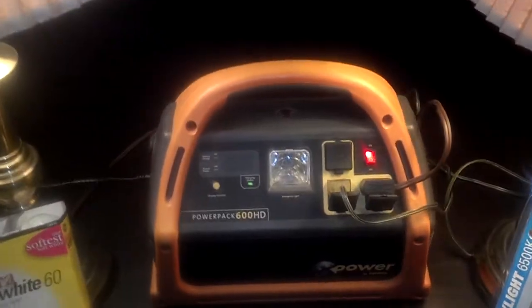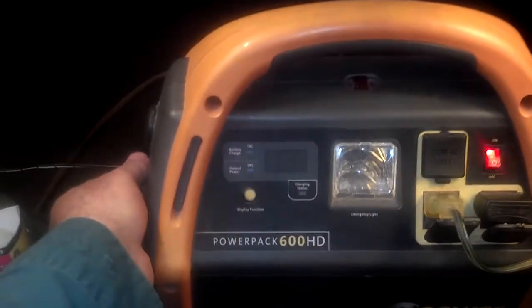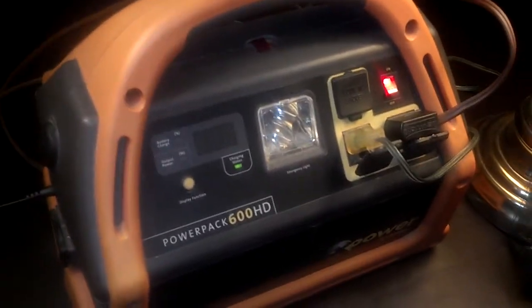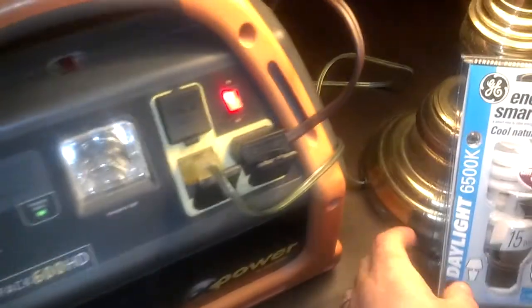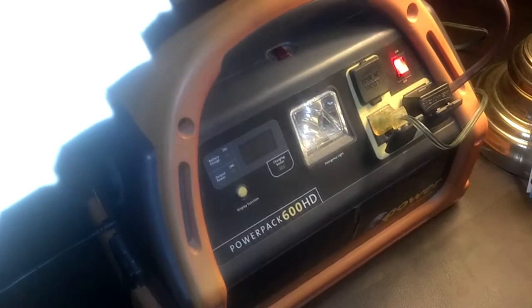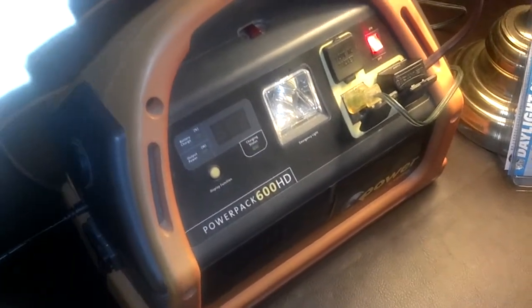Now I'm going to disconnect the battery. It should be 60 plus 23, so 83 watts — I know it won't be quite that, but let's see what it is. Okay, the battery is saying it's 70 watts, so at least it's in the ballpark. I'm going to plug it back up, turn one lamp off, and replace it with a compact fluorescent. When we check the battery again it should be two compact fluorescents — one that's 23 and one that's 15, so they should total 38 watts.